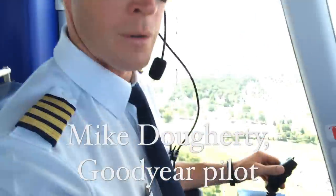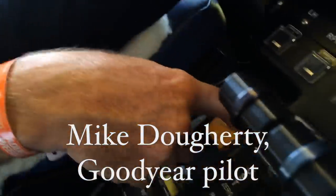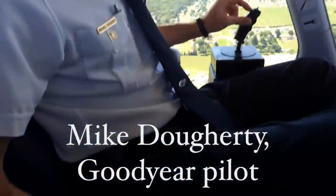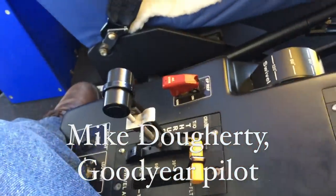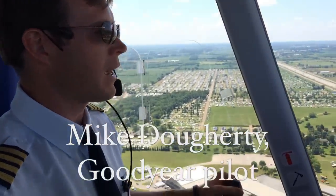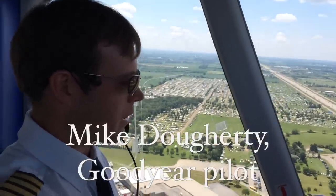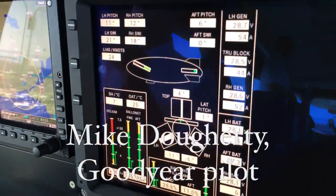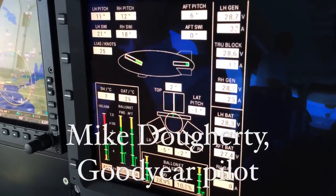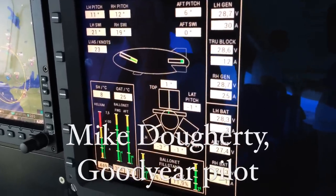When we put it in takeoff and landing mode, that means we take our aft swivel and put it down to 90 degrees, and then we can start using our forward swivels to kind of hang it up like a helicopter. When you do that, all the pitch and power for your aft engine also transfers to your side stick. So what used to be your push or thrust propeller is now vectored down — pointed straight towards the ground. When you push and pull on the stick, it changes the power to that rotor and picks the nose up and down, so it's effectively an elevator. We also have a second propeller that the aft engine runs — a fixed lateral propeller. It's kind of like a tail rotor on a helicopter, so when you push the stick left and right, it changes the pitch and power on that one and moves our nose left and right, just like a tail rotor on a helicopter would.